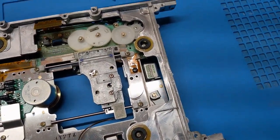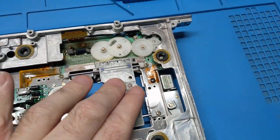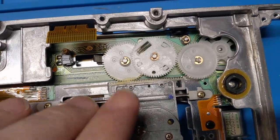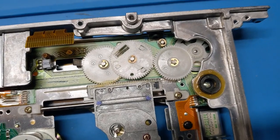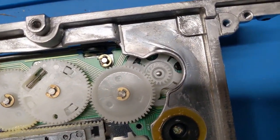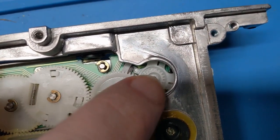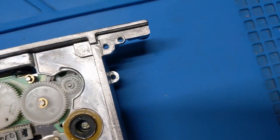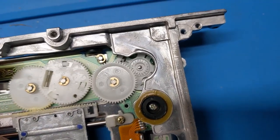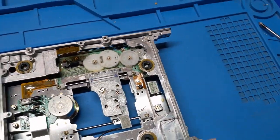First observation: this isn't like the Sony drives — this one isn't linear tracking. It uses a motor assembly here. Let's just do some gear inspection. It's got some grease on it, still pliable. Let's look at the motor gear — it looks like we got a little split right there. It's starting to split. It hasn't gotten bad yet, it still works fine, but that will eventually become an issue. I've got to figure out how to address that before it does.